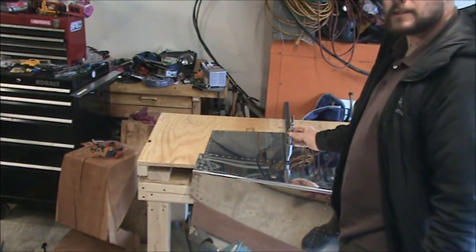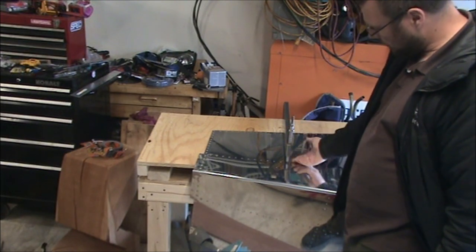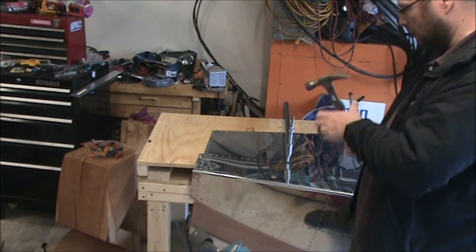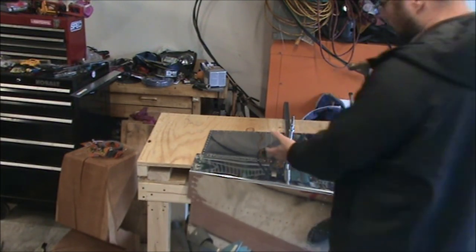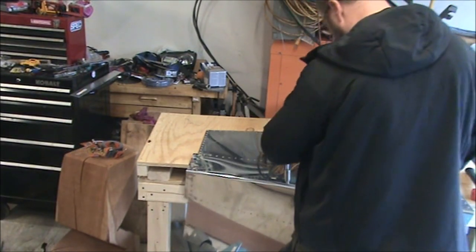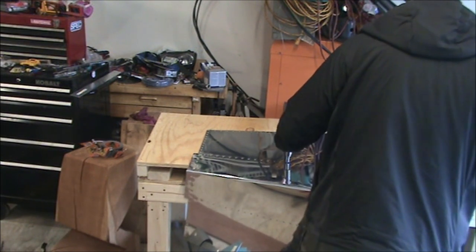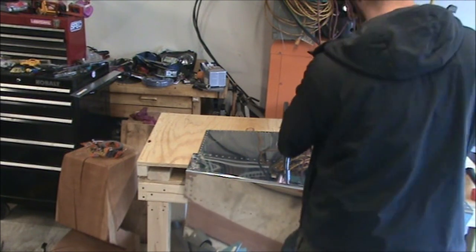I'm really convinced that putting the collar on top with the spring underneath is the way to go for this, and I have it adjusted just to push this up high enough so I can slide the skin through there without it scraping across there. And basically, this is another feature that I really hadn't noticed on other models of this, just the Aviation Tool Supply one, that kind of turns this into a single-handed operation, or a single-person operation.